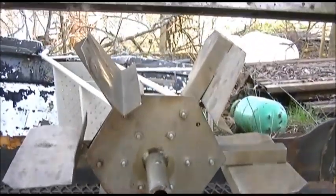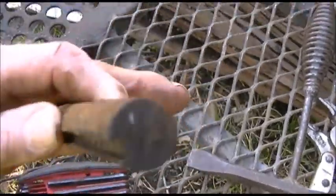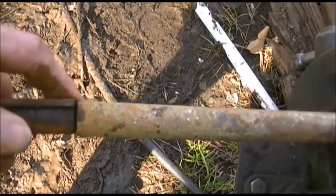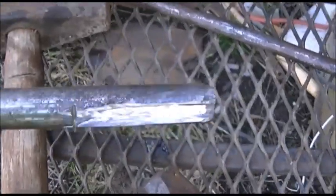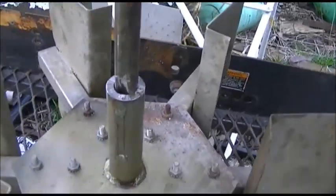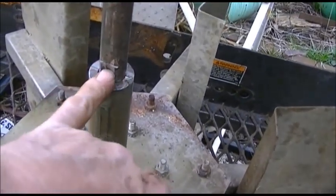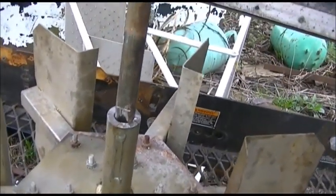So much better — not perfect, but then again, it is after all a pedal. The original shaft had a key slot in it, and one of those original shafts is missing, but I have a piece of stock over here. So what I'm going to do is take my little die grinder and cut a key slot right here. Not a beautiful key slot, but functional — and that's what we need, because all it's got to do is sit in there. This is an idler shaft, so I need to make sure it will go far enough in there so this part here won't interfere with a bushing. I've already spun it and cleaned it on a wire brush, so it's nice and smooth.